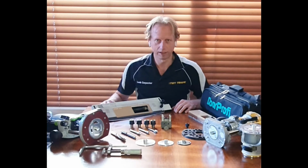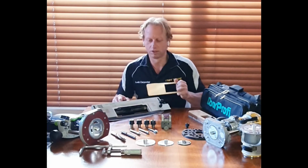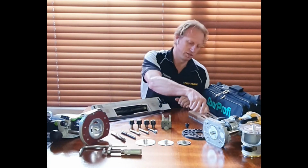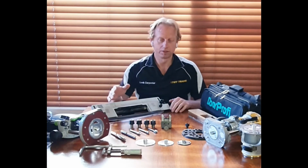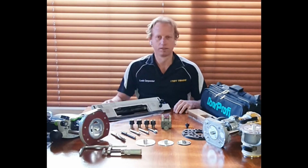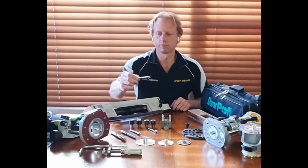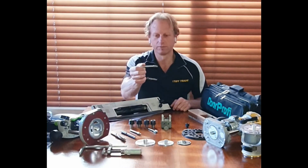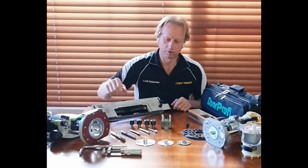It may seem like advanced carpentry, but once you get the hang of it, it's a great skill to have and it's the best way to install. With this, we use copy rings and 12mm cutters for most applications. So that's like butt hinges, lock face plates, shallow flush pulls, things like that. These are kind of long reach cutters for a small shank. And they'll do most of what you want to do.